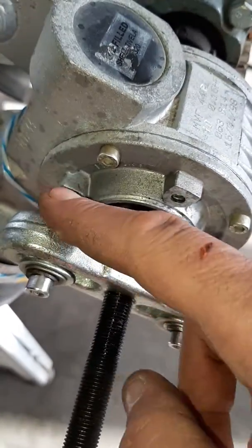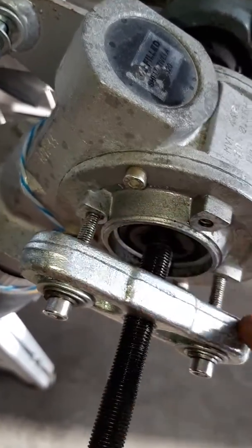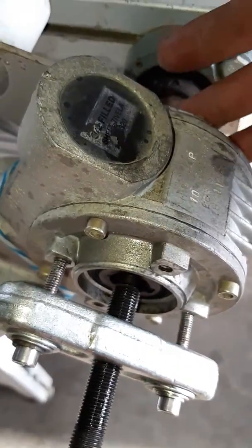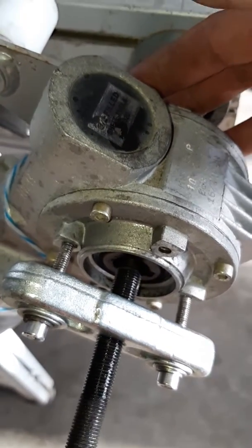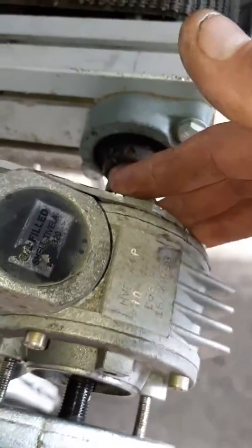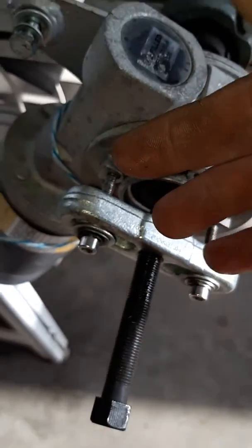Sometimes it's good to take your time — you might snap these bolts off if you go too fast, especially if they're small like these ones. I had to make these ones. And if it's hard to come off, you just help work it off by tapping the back here with a mallet, rubber mallet preferably, or some type of wood, while you're tightening down and extracting it.